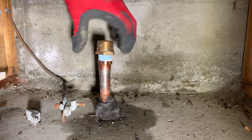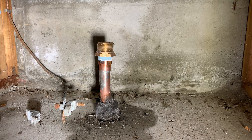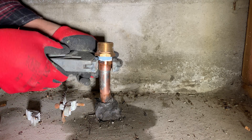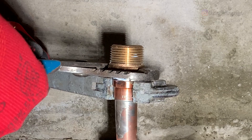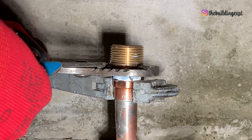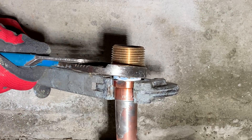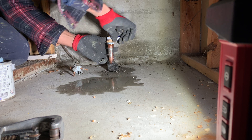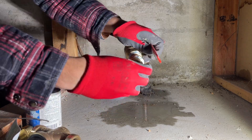I soldered a 3 quarter inch MIP and applied teflon tape and pipe dope to the threads. You might be wondering why I am installing a 1 inch bushing on a 3 quarter inch water service. The reason is that the water service will also be upgraded for this house soon, so just to make it future proof, we will be installing a 1 inch PRV to make it code appropriate.